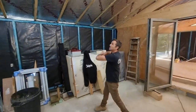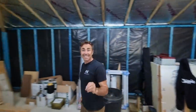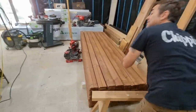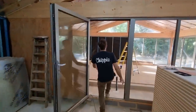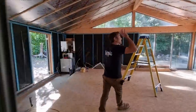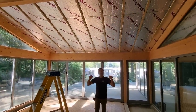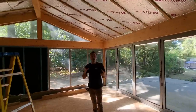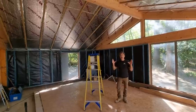We've just got to put the vapor check insulated plasterboard all over that. We've got quite a lot of material collected for the project - we've got our thermowood here, a beautiful bit of thermowood, and this is going to be going on the ceiling of the lap pool in here. We'll be putting a really good vapor barrier up first, then a counter batten, then we'll be using the thermowood. Thermowood is absolutely fantastic in high moisture areas and externally as well.